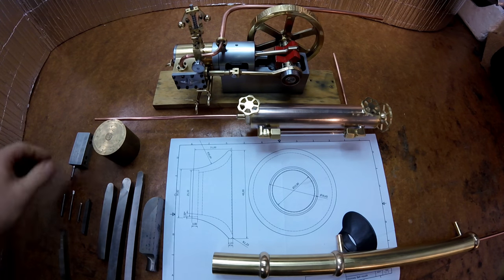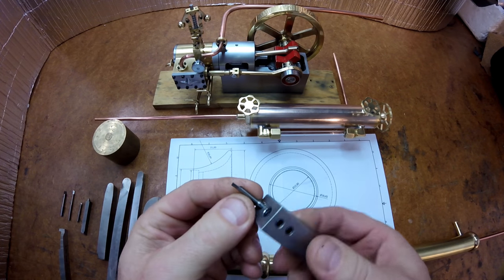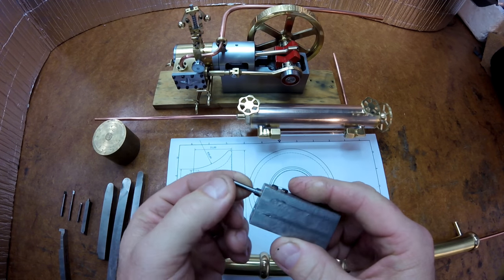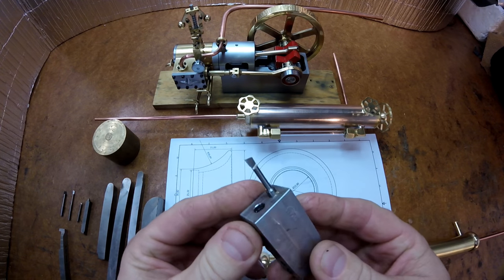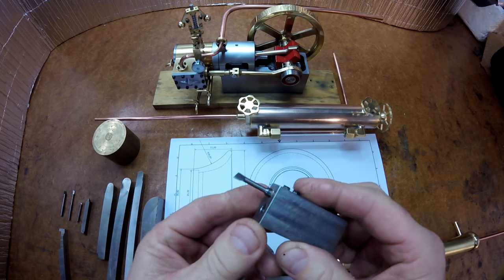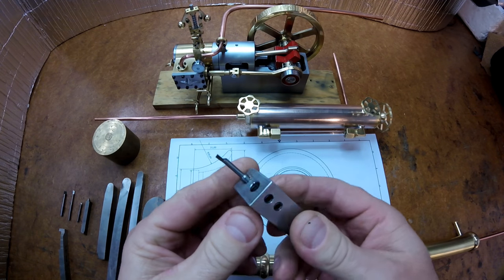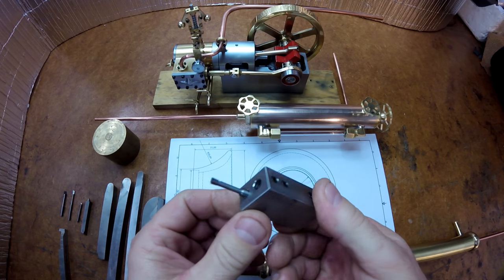You'll often see in my videos, I use a lot of these small tungsten carbide boring bars. I actually make these on a tool and cutter grinder out of old shanks, like slot drills and end mills that have been broken. I use a lot of these. Contrary to their size, they're actually really rigid. I've got no problem at all boring a 25 millimeter bore, 23 millimeters deep for such a small bar. It's great. Great finish. No chatter.